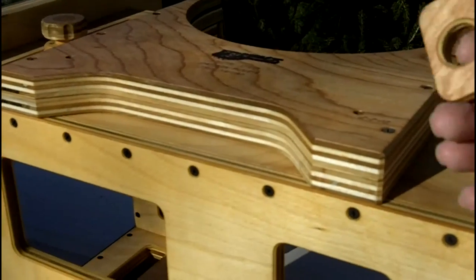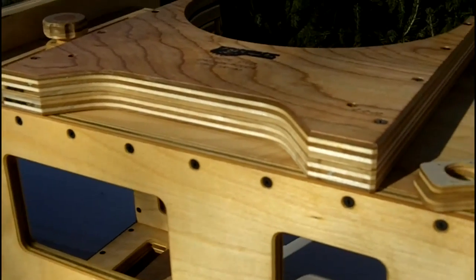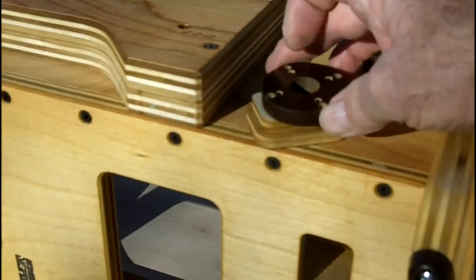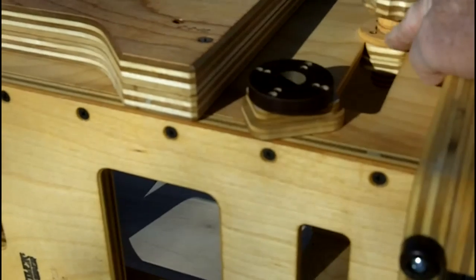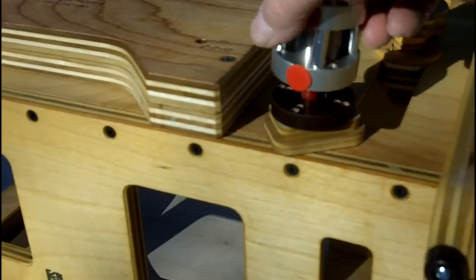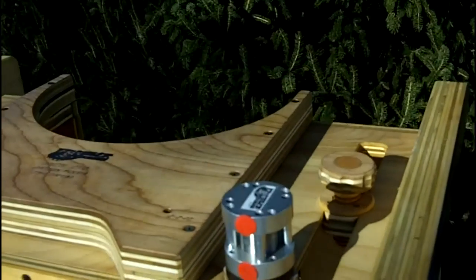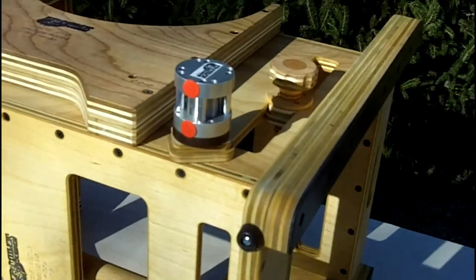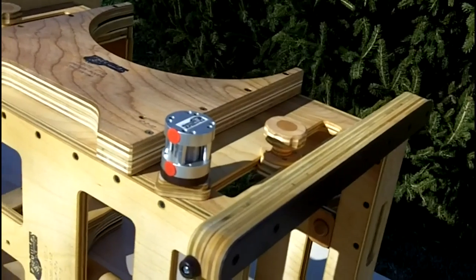We take the standard T-nut, actually it's one that's a little bit different than this, it has a smaller hole in the middle, and we mount on the outside of that an adapter ring that pinches into the same slot as this T-nut and retainer ring, and to that adapter ring we then mount air cylinders in and out. Actually, it's pressure both sides, and very quick clamping. Once that's set up, there's really no moving parts on the jig.